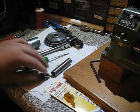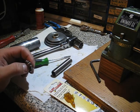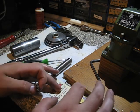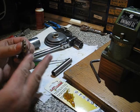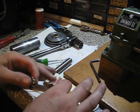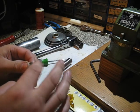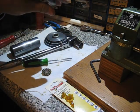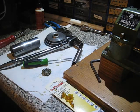The type of grease I use is just normal automotive grease. I think it's called Lumax or something — I bought a little grease gun a couple days ago and it came in the tube. You don't need any special grease; I haven't used any special grease and this thing has lasted this long, so I'm sure any grease will do. I just rub grease and try to pack it in there the best I can in the bearings. I also put some grease inside the little tube that slides over the spindle shaft — I'm not sure if it really needs it but I do it anyway.